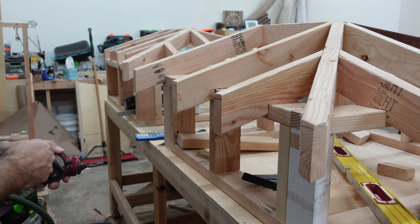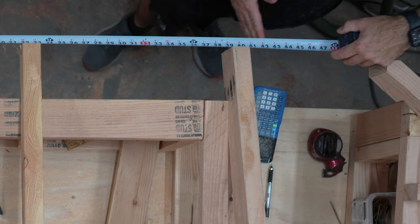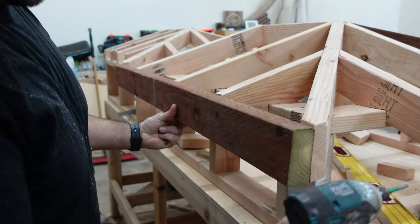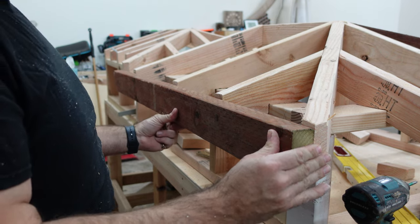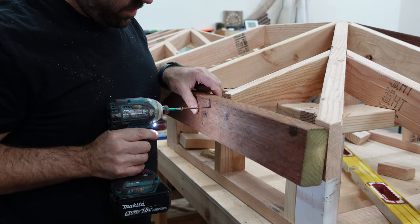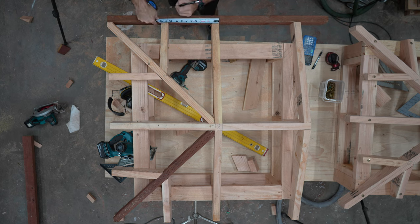Once the sub fascia height is marked, we are now ready to install the sub fascia. My model is small so I can go the entire sub fascia distance in one board. I measured from the hip to the outside face of the gable end rafter and added six inches — the distance I want the overhang to be. I set the board on the line and then screw it in. If you have more rafters and can't do it in one board, just make sure to end each piece on the center of a rafter. The reason for the snap line for the sub fascia is to straighten out somewhat crooked lumber.